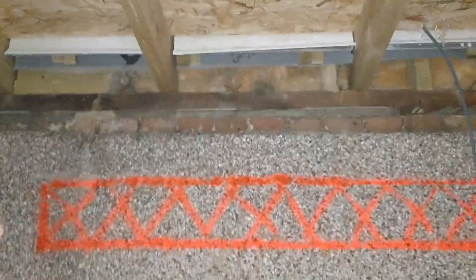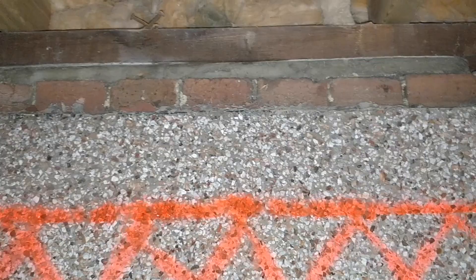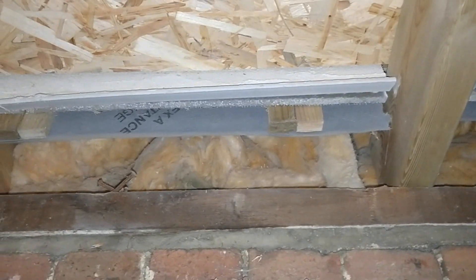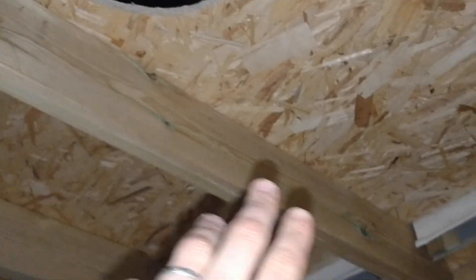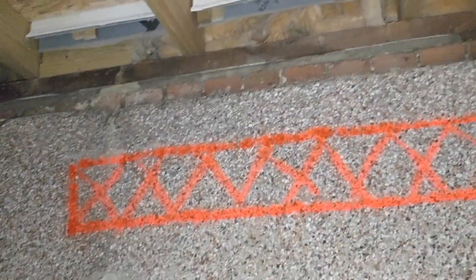On this side we've got absolutely loads because the doorway opening isn't going to be any wider than here, so we've got a lot of bearing on that side. We're very fortunate because we're up to the original wall plate just here — just four courses of brick above this is the wall plate and there is nothing above there. There are these joists which are not especially load bearing because there's no weight on this bit — just 18mm OSB and that's it. The supports for that wall construction bridge across and there are pillars of support — one there, one there.